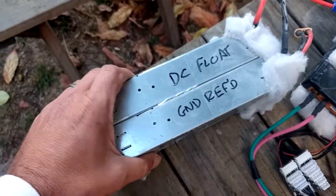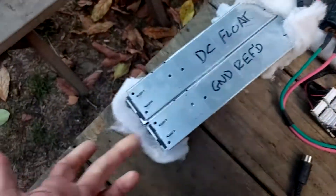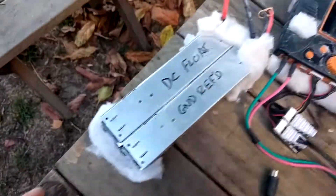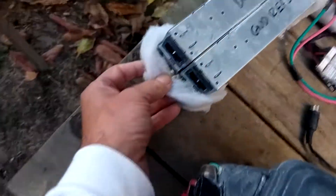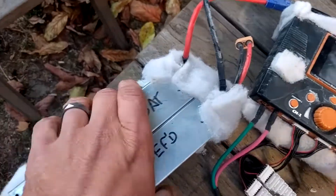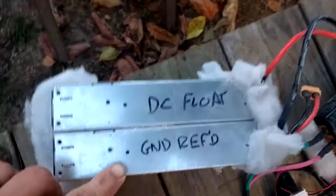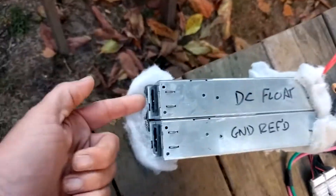This is the charger, which is a very good charger — pretty expensive, about 400 bucks, but really good. It runs off 24 volts, so I'm using two 12-volt server power supplies, each of which does 75 amps. Notice the liberal use of HEPA air filter, which you really want wherever air goes in or out. I just hot-glue this stuff on — it's fantastic, keeps all the playa dust out.